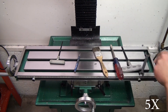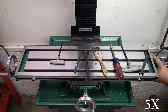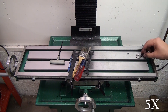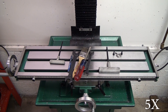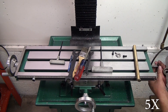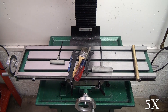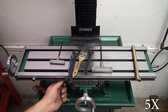You'll also need to remove the outer bearing race. I have one of these cheap Harbor Freight bearing puller sets so that's what I used, but you could probably work at it with a couple of screwdrivers, a chisel, or cut it off if you have to. Just get it out of the way and then you can remove the table end cap, which just takes a couple of screws. There are also a couple of dowel pins so make sure you don't lose any of that stuff. I used a brass drift to drive mine right off and it came off pretty easily. If you're nervous about losing any of that stuff, now would be a good time to start organizing things with ziplock bags.